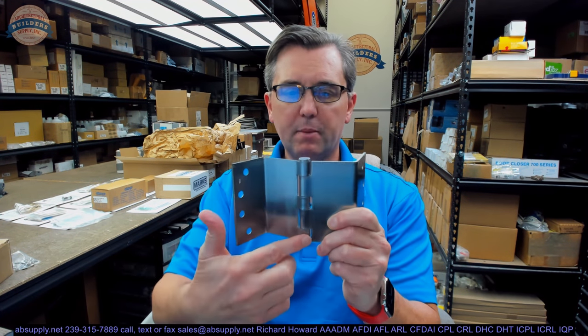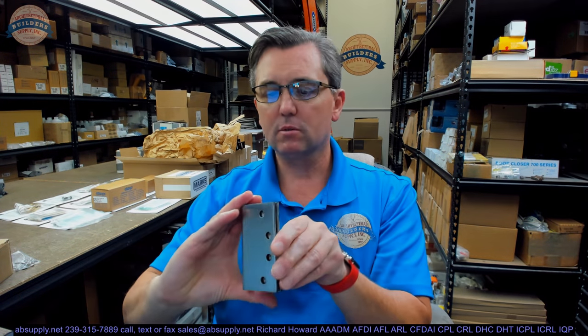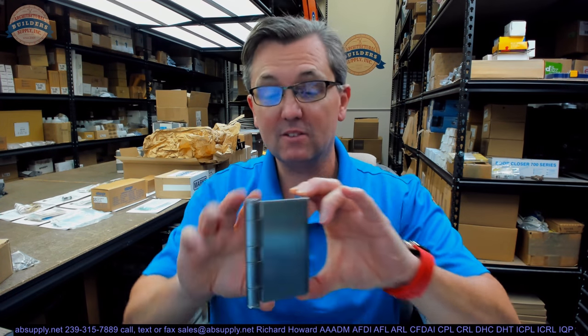Now let's do a tour of what's in the box. You're going to get the hinge. This is available in 3.5", 4", 4.5" — and quite sure they can do 5" as well. They can do this in standard weight, heavy weight, 5-knuckle plain bearing, 5-knuckle ball bearing, or 3-knuckle concealed bearing. Stanley is extremely capable — more capable than other manufacturers when it comes to ordering off the menu. I've asked them to do things that everyone else has said no to. Stanley's fit and finish is very good — the hinge looks presentable, and you're paying money for this hardware, you want it to look nice. Stanley always does a very good job with that.